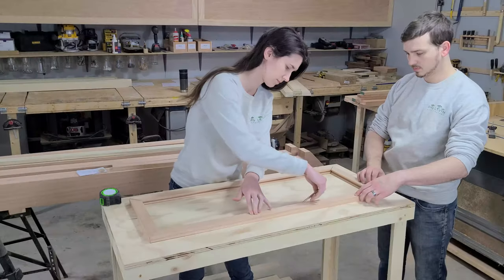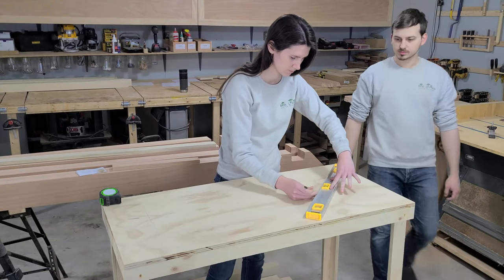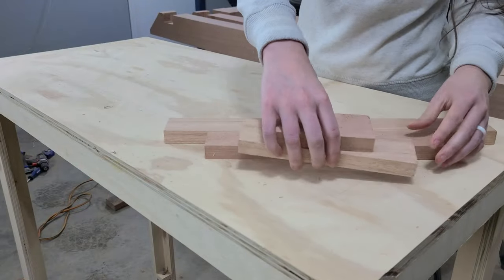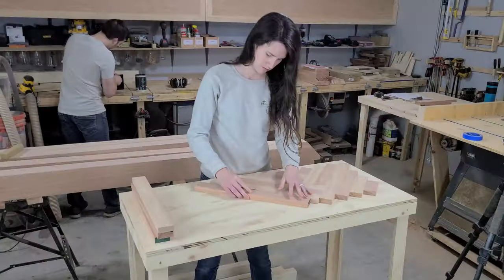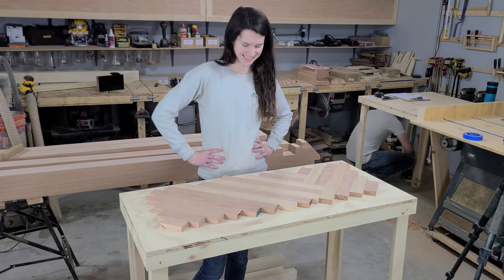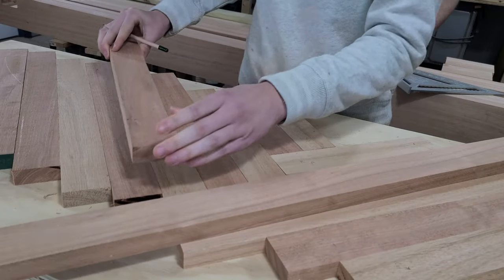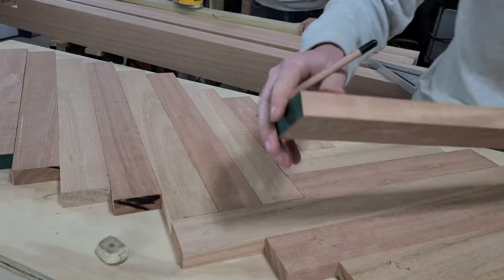To make this process easier, we brought the frame over to a work table and traced out its size so that we had an exact guide to fill and start building our pattern off of. With a reference sketch on hand, we now start crosscutting the pieces on the table saw using our crosscut sled. Since we have exactly enough material to make these panels, we can't afford to mess up one of these cuts. We also have two different tones of wood that we are working with, so we try to intermix these colors together to create an intentional pattern. And since we have two panels, we have to duplicate each piece so that the patterns match. We eventually have both mosaics put together with literally the exact right amount of material. There's just one little gap that we'll have to fill in with an offcut after we trim these panels down to size.